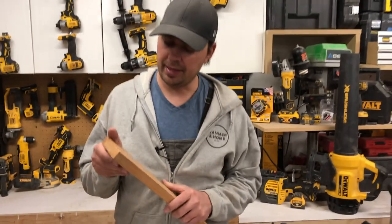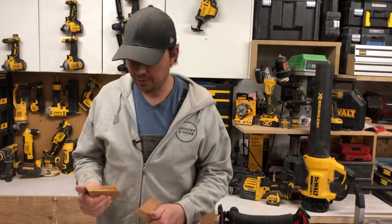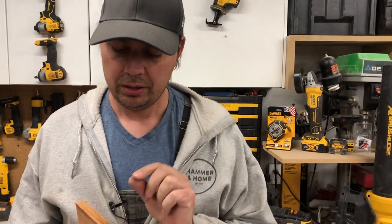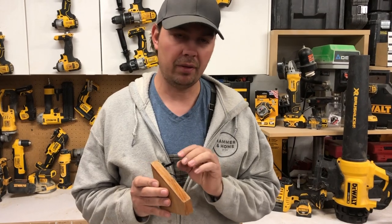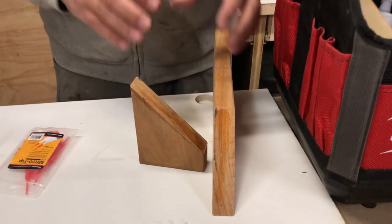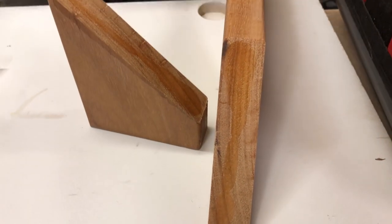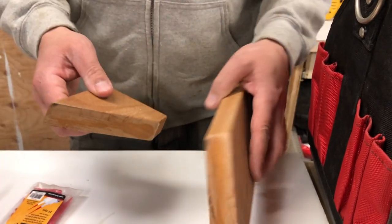So let's try and take this apart. There we go — I had to put a fair bit of force on that. I will note this is batu wood — very, very hard, solid wood, not very porous at all, so the glue isn't really sucking into this wood. If I used MDF it probably would have even been harder to pull apart. If I had left this longer, I'd be smacking it against the table to break this joint. Really, really cool stuff.